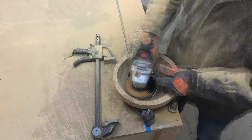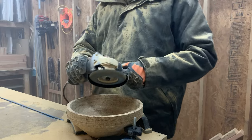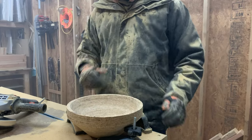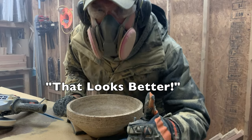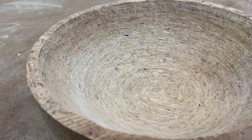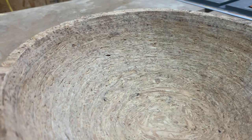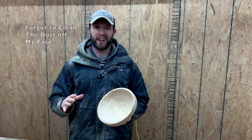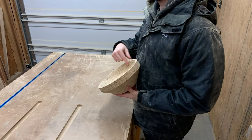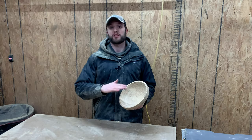The decision to go back to carving the bowl even more was a tough one, but I really didn't like the shape that I was left with. One thing I did notice was that as the bowl got deeper, the dust came straight back at me. Again, this project is a super messy one — I'm absolutely covered in dust. That looks better! I'm pretty happy with how the carving of this bowl turned out. I only used one 60 grit flap disc on this project, and the disc was definitely getting worn out by the end, but it really just helped keep the bowl smooth to prevent gouges. I think this looks way better now — I'm glad I went back and did some more grinding to thin out the border. Now although the inside looks pretty smooth already, there are still some ridges, so the next step is to grab the sander and smooth everything out.